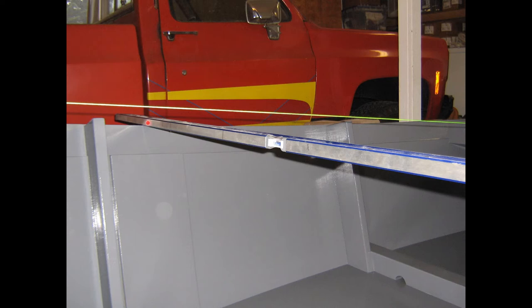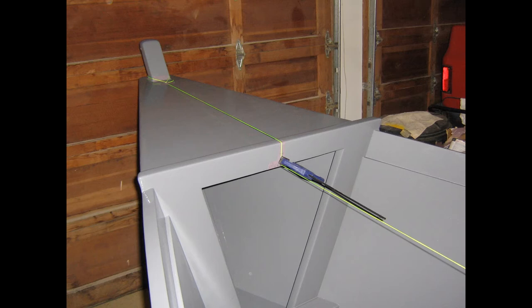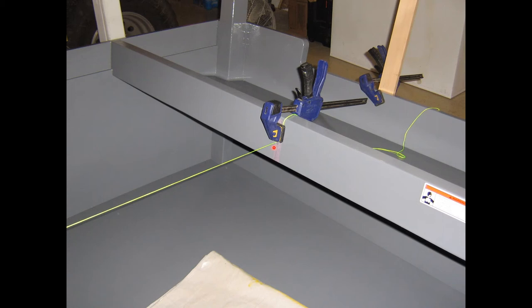So that is our initial yellow line in the previous cartoon, that top yellow line. But as you notice, if I put a level across the side of the boat, this static float plane or this string is well above what it would take to swamp the boat. So we need to lower this string line, and it turns out it was 3 inches from here to here. So I lowered the string line 3 inches at the bow and at the stern. So now this string line, this is where it originally was on this board clamped on the stern. By moving our static float plane down 3 inches, now the static float plane is actually just a quarter inch